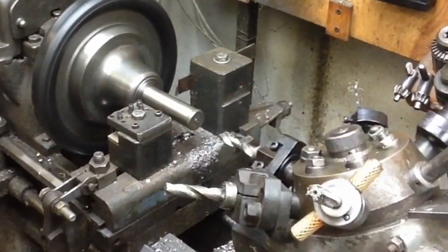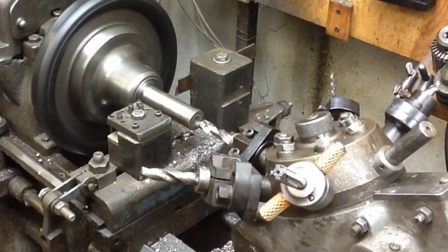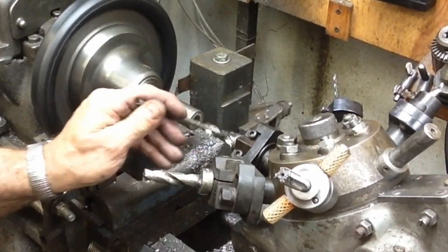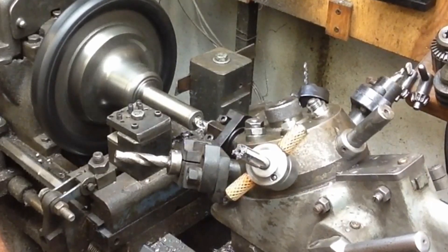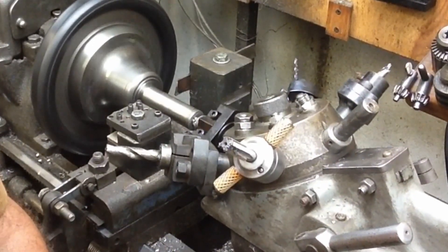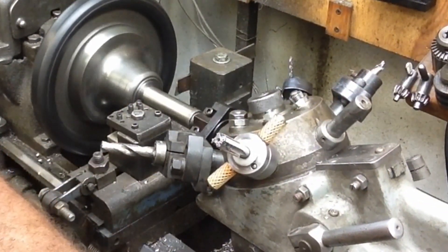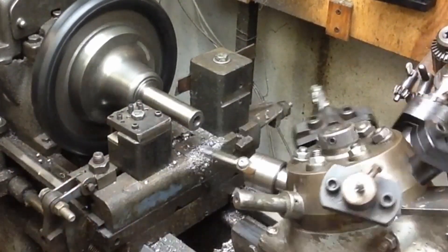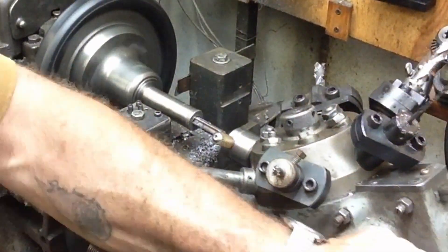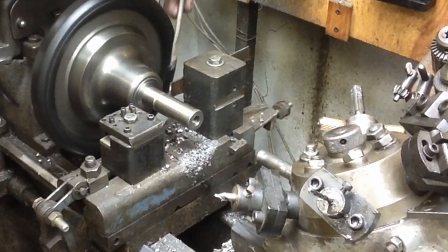One thing that would be a major time saver would be to have flood coolant on this machine. I will have flood coolant when this is converted, and actually I'll have it on the other shell lathe when it's rebuilt too. I spend a lot of time clearing chips here. The flood coolant would run things cooler since right now I'm oiling by hand, and I'd get much better chip evacuation. I think I could cut probably a third off the cycle time. Cycle time for these parts is about seven to eight minutes, and with flood coolant I'm very confident we'd be under five minutes, no problem.